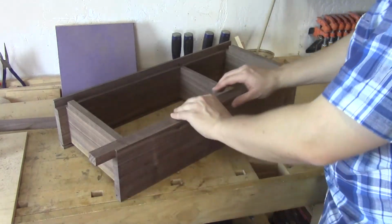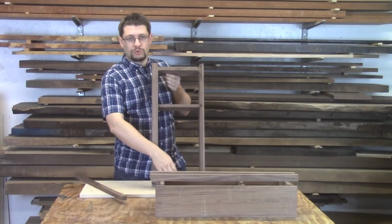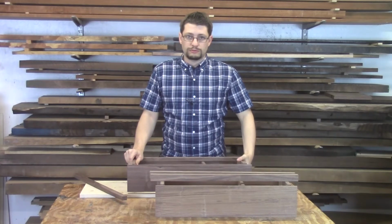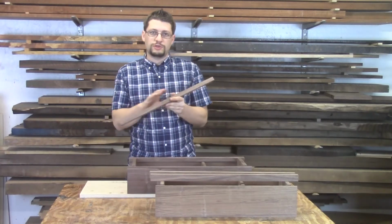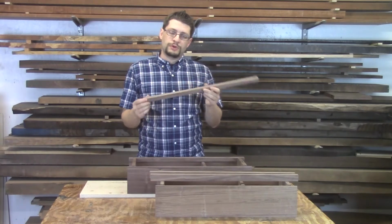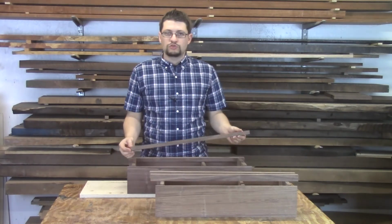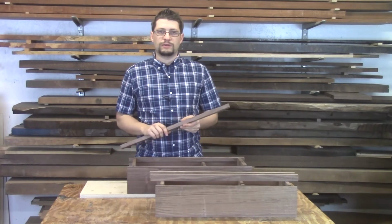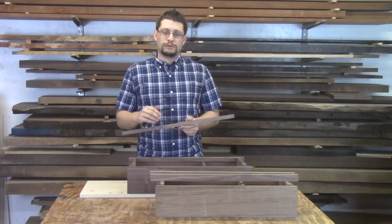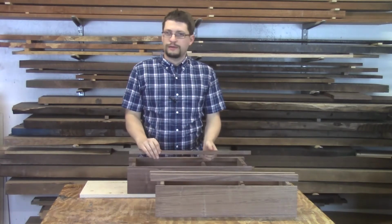And the other technique, which I'll shoot with the other cabinet, is to, once you finish surfacing, so you do your finish surfacing on these parts, that instead of bringing it down to a final thickness, you bring the part up to the cabinet, scribe in what that final width is, and then with the chisel, you come in and remove the material so you can sit this piece inside.